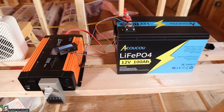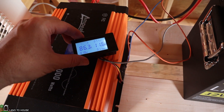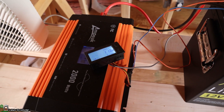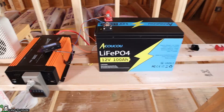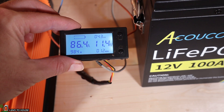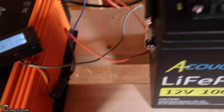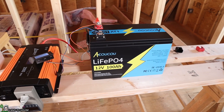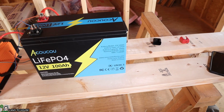My time calculation was off. It's already been 71 minutes and we've got 7.1 amp hours left and we've used 1.1 kilowatt hours. So we are doing fantastic with this battery. Almost done and it looks like we will be able to hit 1.2 kilowatt hours with this battery. The screen says 1.2 kilowatt hours consumed and we've still got 4.3 amp hours left. The display does not show detailed enough information to get that last bit, so I'm going to go ahead and call this test. You can see that it has performed very well — perhaps even a little bit better than the 1,280 that we have on the rating.